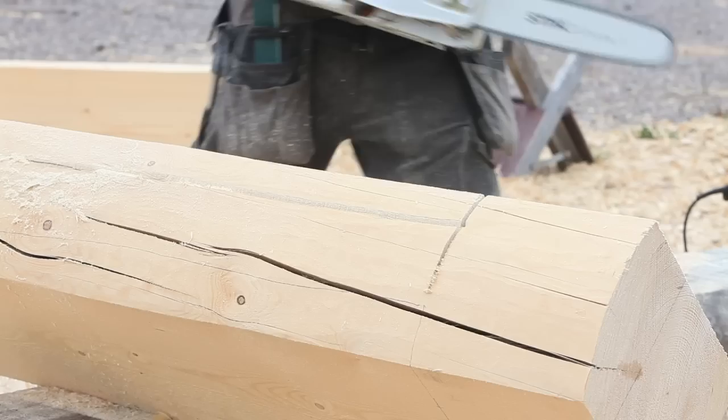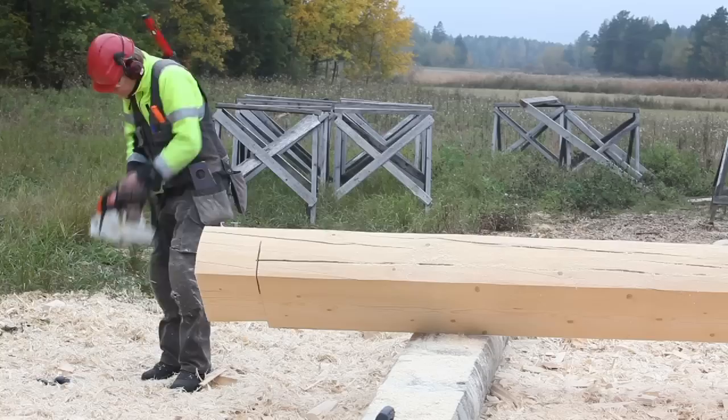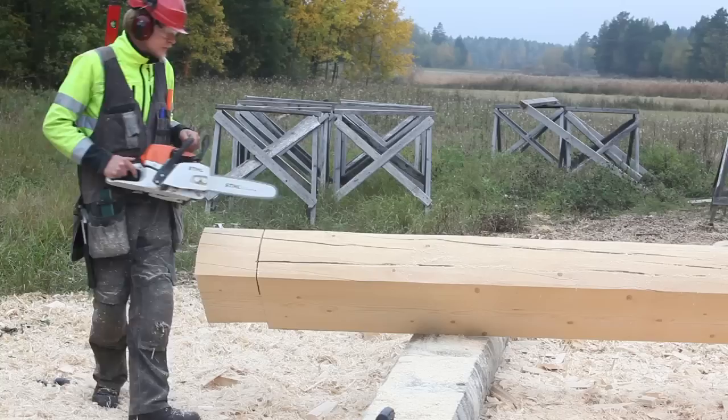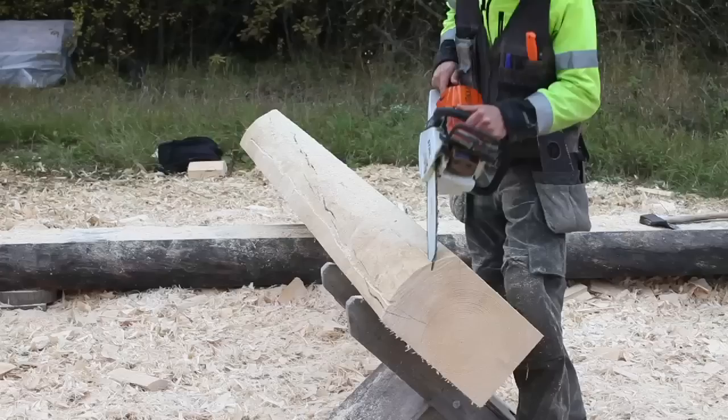The results reinforced our theory. There is a gap in the groove on the warm side of a wall in most heated log buildings made until this day. According to the latest knowledge, sealing of construction elements should be airproof on the inner side of a wall. However, the current method using semi-dry logs is not sufficient to ensure a balanced solution to the sealing of a log building.